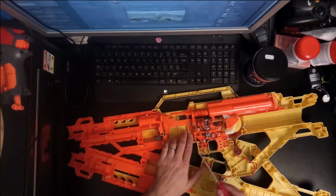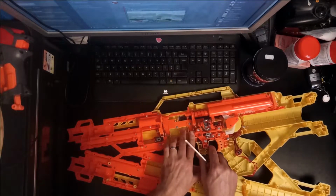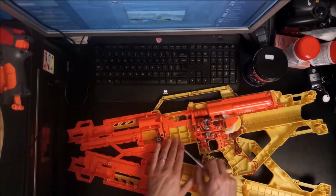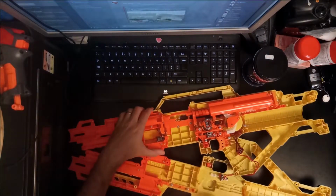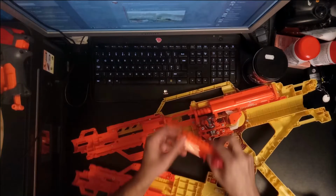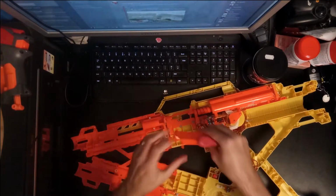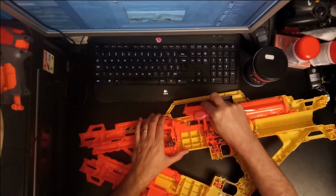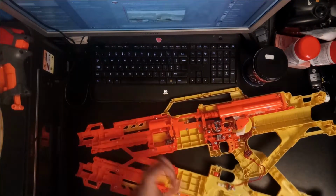You see there's a switch on there. So when you've got the magazine part way in, it'll push this back. You've not got a mag sat properly, it'll disconnect that switch, put the magazine in properly, it comes back out. So yeah, do you have a magazine? Do you have a magazine in the right place lock? And you'll probably struggle to see it, but believe me, there's another one just tucked in here that is activated by this little knob here, I should say, on the door. Yeah, that just pushes in there, pushes the lock, and again, that's your jam door lock, and that checks whether it's shut.